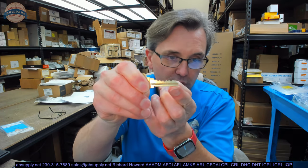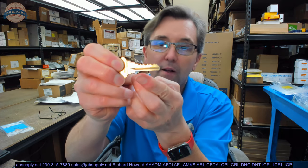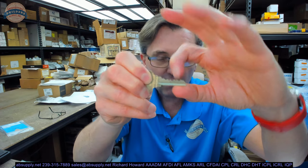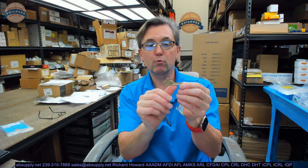So why would a nine cut be a smaller number than a zero or a one in terms of that decimal? The way that depths are actually measured — it's measured from the root of the key to the depth of the cut. If I put my caliper in there, I'm going to get that decimal point. So theoretically, if I know the center of the first cut and the successive centers, and I know the depth from the root to the bottom, I could — in theory — create that key.